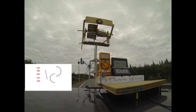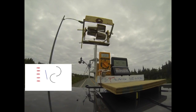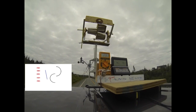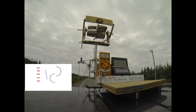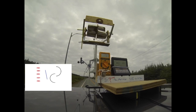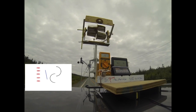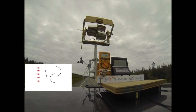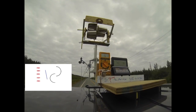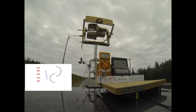Right now the wind speed is more or less equivalent to about 90 kilometers an hour, and the turbine speed is a little over 200 RPM. This means that if we look at a linear relationship, we should be able to go to 160–180 kilometers an hour and still keep the turbine RPM well within the tested speed limit.